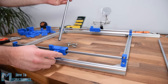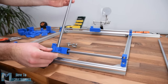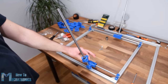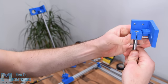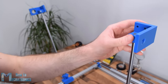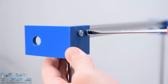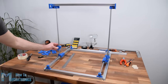Next we need to install the Y-axis. First we insert the rods into the X-axis sliding block, place them flush with the bottom of the part and secure them using M4 nuts and bolts. Then we can insert the Y-axis sliding blocks, which use just a single linear bearing. On top of the Y-axis rods we attach mounting brackets connecting the two Y-axis rods with a T-slot profile on top. I added M5 bolts and T-slot nuts, slid the profile in and fastened the bolts. With this, the main construction is built and we can freely move in both the X and Y axes.